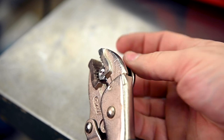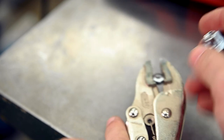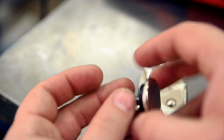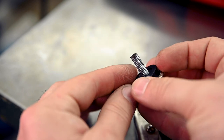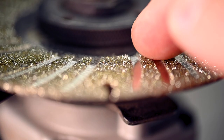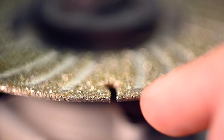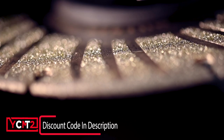And the reason I put that nut on the end is now I can just unscrew this and that'll fix the thread to make sure that the thread is fine on this, because sometimes when you cut a bolt, the thread gets all gummed up, and my diamond disc seemed to cut a little slower than normal. Yeah, check out the texture and compare that grit versus the end, how it's kind of smooth. I've worn through the diamond pretty well. There's still some life on it.